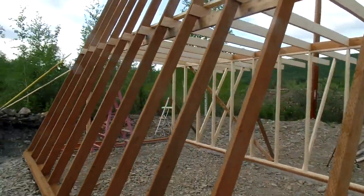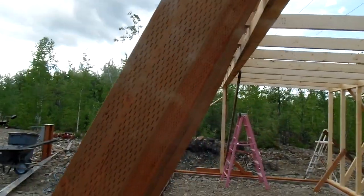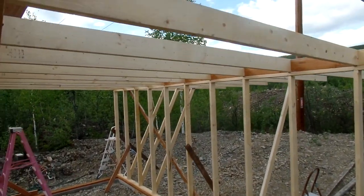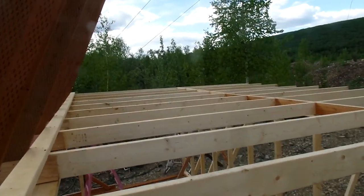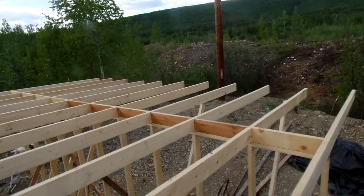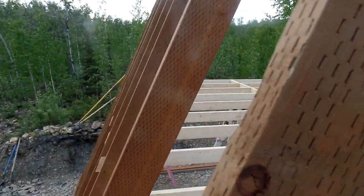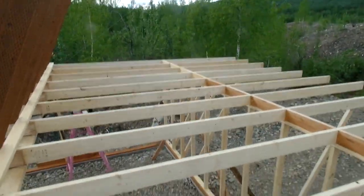Now to me this is the moment of truth - does everything line up? Oh yes. If you've done it correctly everything's in a plane; if not, you'll see one frame member sticking up. I actually got one joist that really arced downward - I probably should have rejected that board when I bought it. So topside done - a nice plane of spars, which is good because my solar panels all sit in a nice plane.